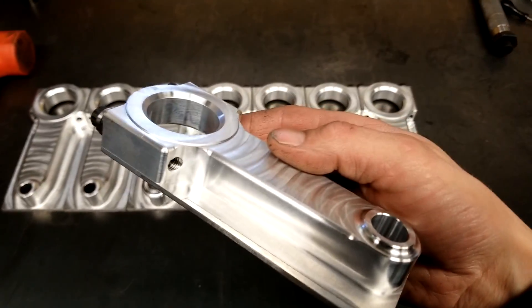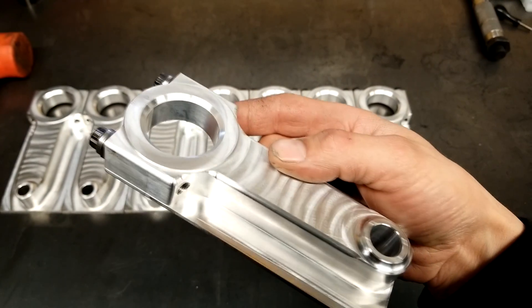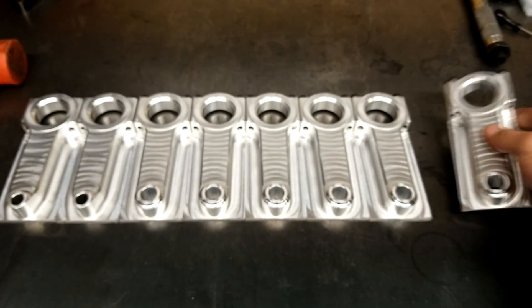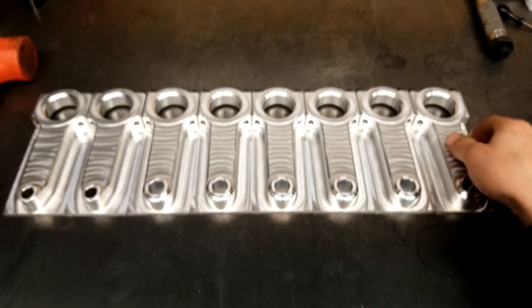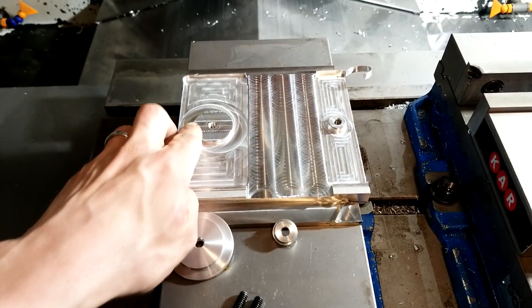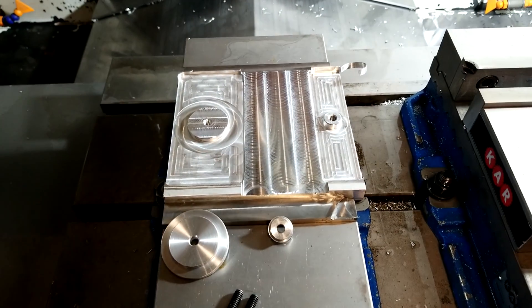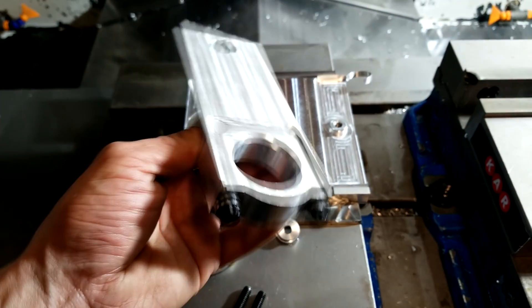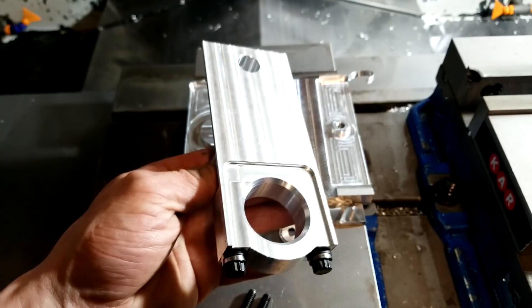This is what they look like now, completely done on one side, with the leftover of my holding material still needing to be removed. For this operation, I am going to make a fixture to hold the rod that will also be reused for future operations. My fixture has threaded holes for both rod diameter and it steps so it sits flat on its holding. I also made these locating steps — with these, I need way less pressure to hold the rod as it has nowhere to go.